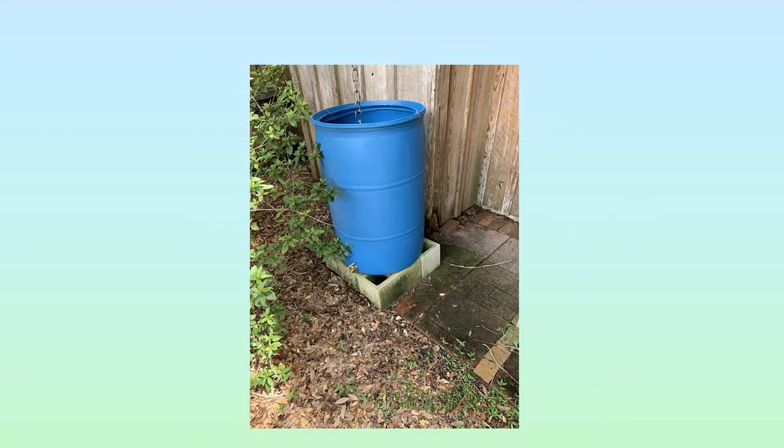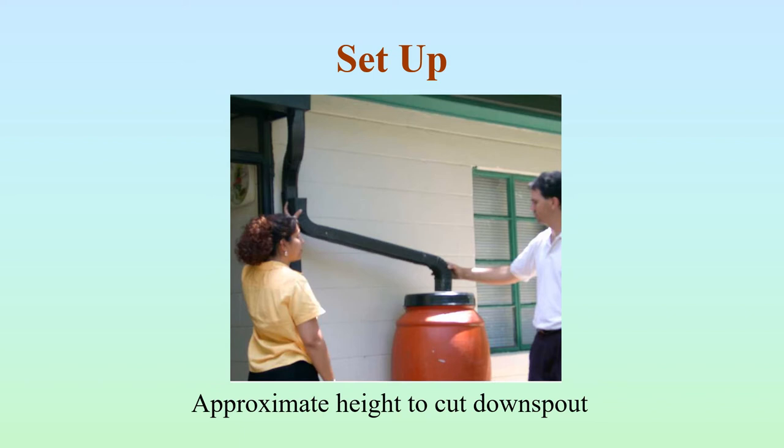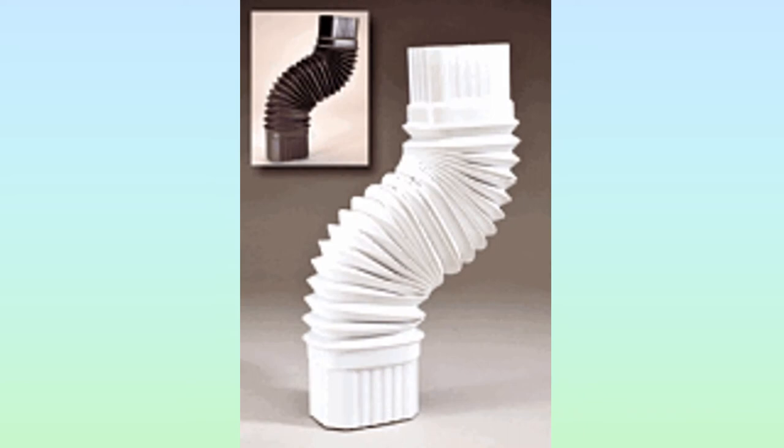You can see here's my neighbor's barrel that I made for him — he put just one layer of concrete blocks and a stainless steel chain as a guide to bring the water into his rain barrel. It looks beautiful, but he has a difficult time getting his screen wire on to protect against mosquitoes breeding in the rain barrel, so I don't recommend leaving the top open like that. The way I do it — and most people do — is you remove a section of your downspout, reconfigure it to go over to the top of your barrel, and it will guide the rainwater directly into the barrel. You might also use a diverter, which you can buy at any hardware store — they're very inexpensive — just to guide that water over into your barrel.